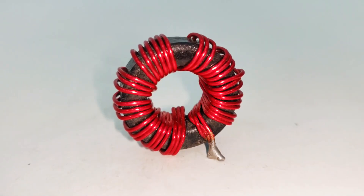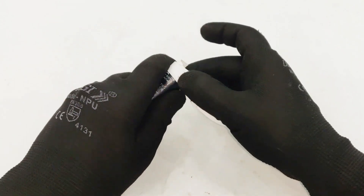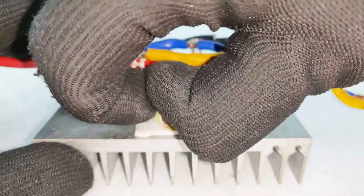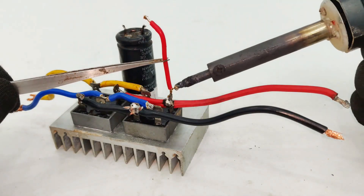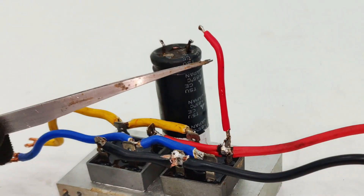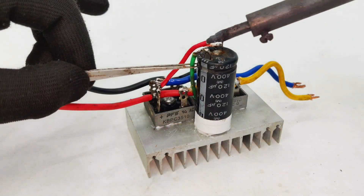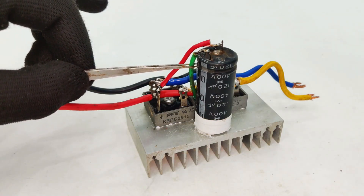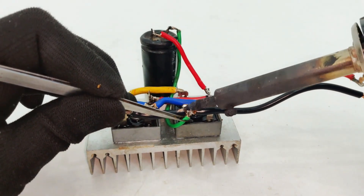And lastly, this thick winding inductor. Step one is to fully insulate the capacitor both electrically and thermally, and after that install it somewhere close to the rectifiers. Next, take a red wire and connect the positive of the capacitor to the overall positive output of the rectifiers. Then take a different colored wire — black or green — and connect it to the negative of the capacitor and then to the overall negative of the rectifiers.